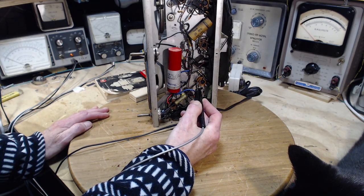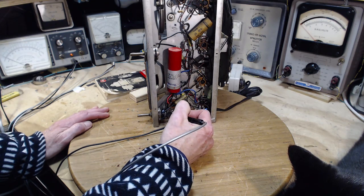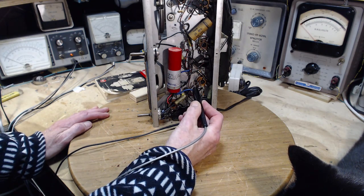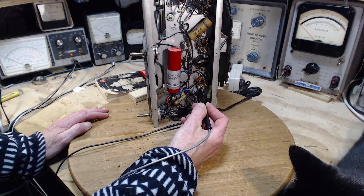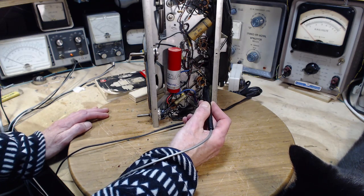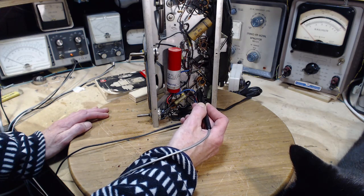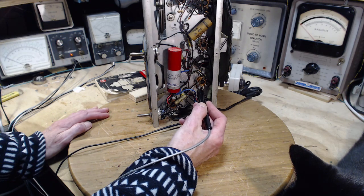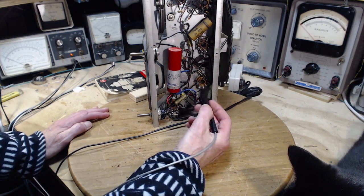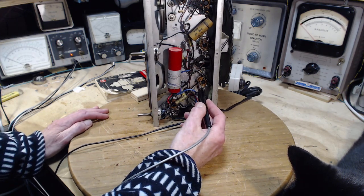So that's going ever so slightly negative. You can hear it. It has a capacitor from the volume control. It has a fairly large, looks like a 1 meg resistor to ground right off it. This is the grid of this tube. This would be the preamp. This is probably the detector and preamp for the output tube. The detector for the radio, preamp for the output tube.